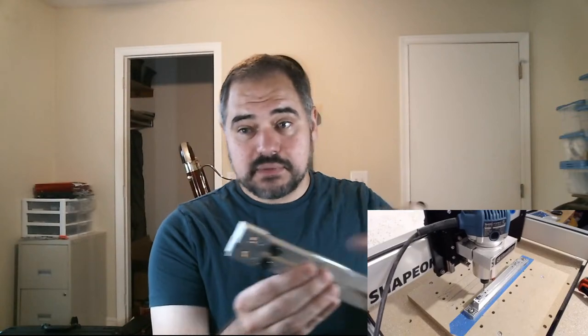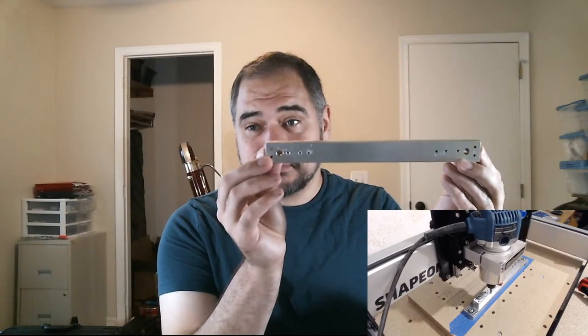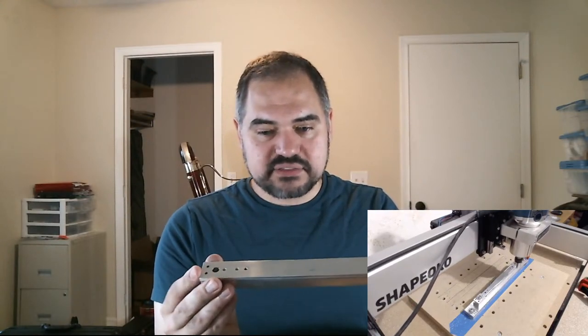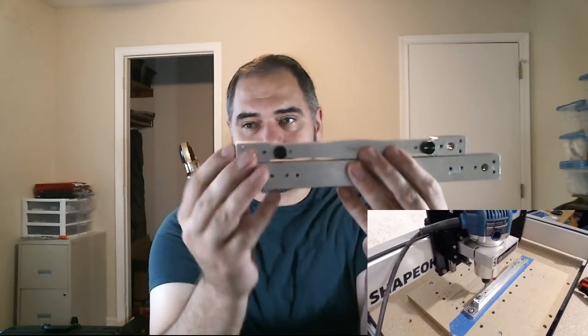So right now I have my soprano crumhorn, my tenor crumhorn, my subcontrabassoon. Over here my alto crumhorn is in progress. Then we have the slightly bigger bass crumhorn. Bass crumhorn reeds are really better made with contrabassoon cane rather than bassoon cane. The other crumhorn shapers are designed for 120 millimeter bassoon cane. I usually gouge it a little thicker, but otherwise it's bassoon cane. For the bass, you see it's quite a bit bigger, both wider and longer.